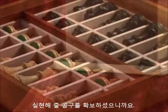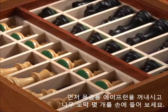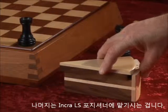Secure the right angle fixture to your table with a spring clamp and clamp two pieces of stock with a backing board to the faceplate. You can use your centering board as a backing piece. Securely tighten the hand screw clamp, then remove the spring clamp.